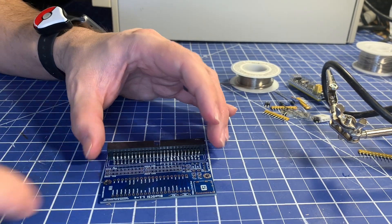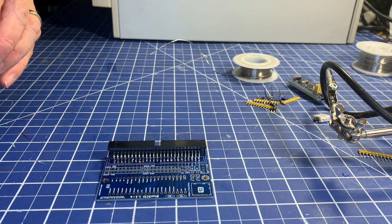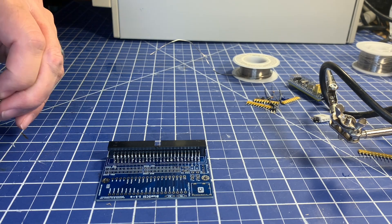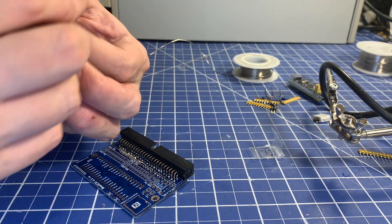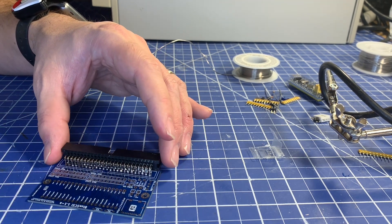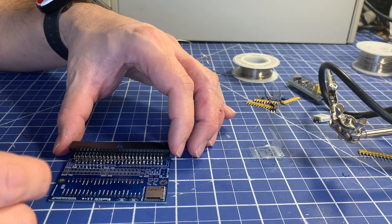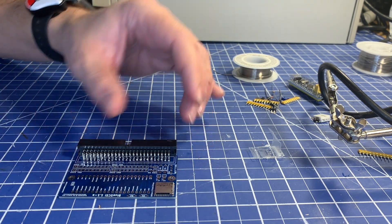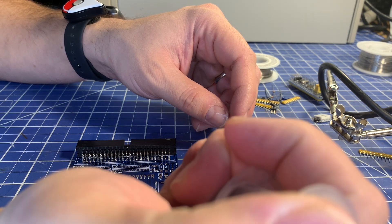Next let's flip it over and do the micro SD card slot, which can certainly be tricky. We're going to use a technique called drag soldering — that's where you get some solder on the tip of the iron and drag across the contacts to get those things to stick. We need to make sure we get this in the right way. It looks like they've changed the orientation since I last built one of these Blue Scuzzy devices — the pins used to be on the back. So first I'll hit it with flux, because you can never have too much flux.